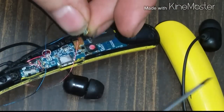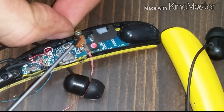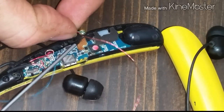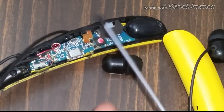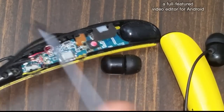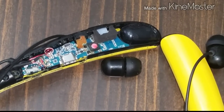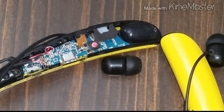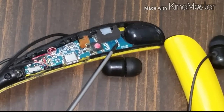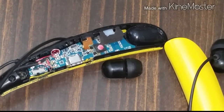Create a good solder connection, then solder them to the board, fit it inside the microphone piece, and put a piece of tape over the back to keep it inside the rubber piece. That should get everybody started on replacing their microphones. Unfortunately, I don't have a spare earpiece to try this on — it's an untested procedure, so again try this at your own risk. If your microphone is already messed up, there's not much you can do to make it any worse.